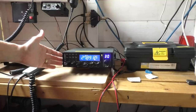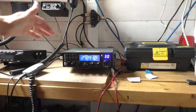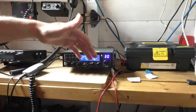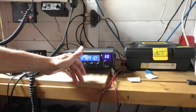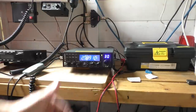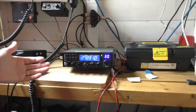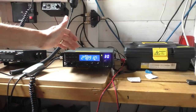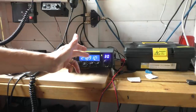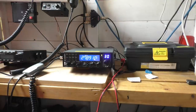And as I mentioned on the last video, if you're starting out from scratch and you're not using old equipment, I know these are out of stock at the moment, but if you can hang on and wait, I would definitely think about starting with a sideband radio, because I explained on the last video, if we get DX coming in the summer and in the autumn months, you've got a chance of getting foreign contacts. And a lot of people like myself like to use DX because you can get out further and talk to more people. So yeah, if you're starting from scratch, a multi-band radio like the 6900 is a little bit more to learn than the older radios, but it does give you AM, FM, upper and lower sideband. It also does CW, which is Morse code, if you're really into that.